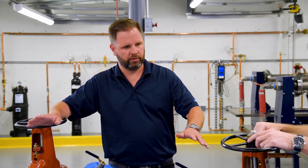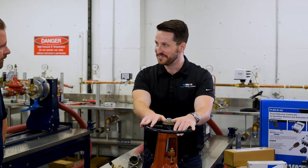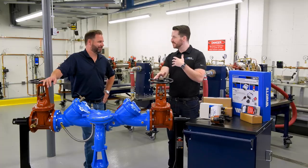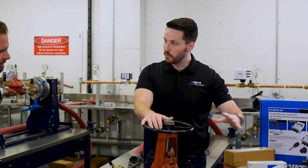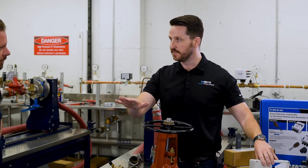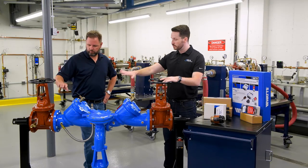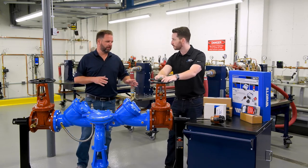You're sensing for water 365 — you've got year-round coverage. What else does the Sentry Plus Alert have? We can connect this to one of our LFF 113FP flood protection ACVs — an automated control valve. You can put it upstream of the backflow preventer, and when the system goes off and sends out the alert, the control box will talk to the ACV. The ACV uses a little solenoid and the existing pressure in your system to hydraulically close, and that way you're going to be able to close the valve and isolate this off from the rest of the system to hopefully stop that discharge. So essentially, if you add the ACV in conjunction with the whole setup, you get notified and you can shut the problem down right then and there.